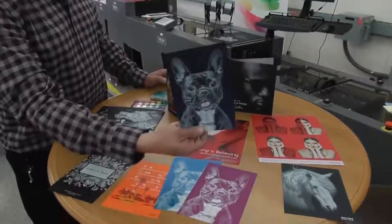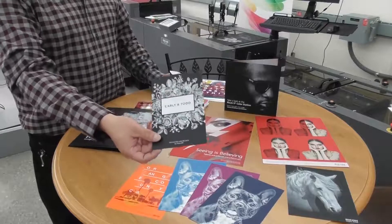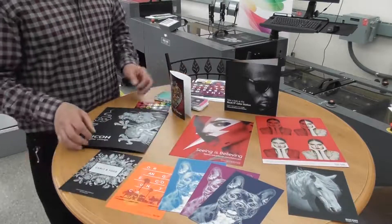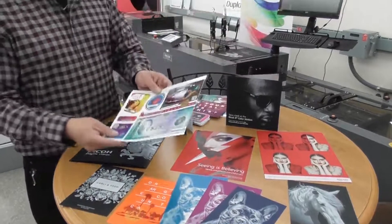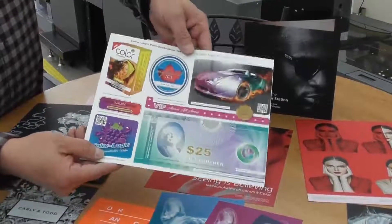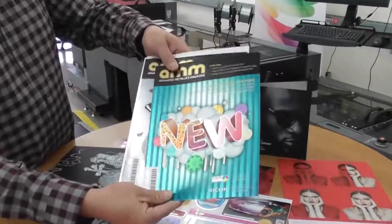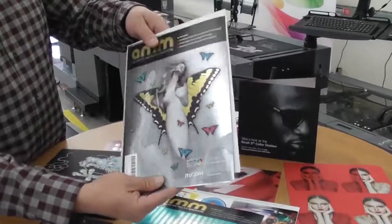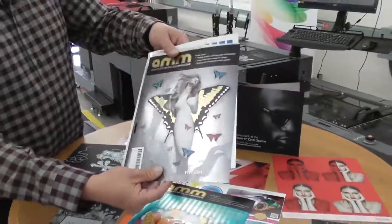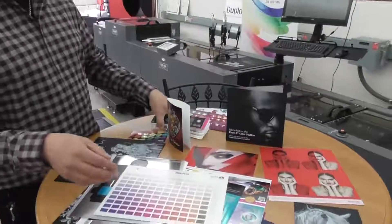What's unique about the 7200 is the different substrates you could print on, such as colored medias. Being able to print on blue media, purple media, light blue media, and also black medias by laying down white with white opacity. You're also able to use silver medias — all in one pass — by laying down the white toner and then CMYK on top. Here are a couple examples, including metallic carton boxes and metallic colors.